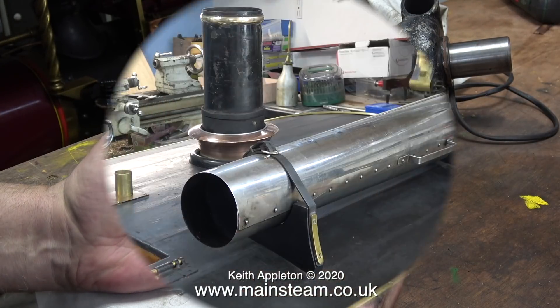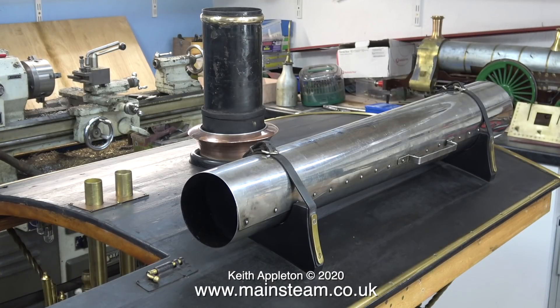I need to make a blower for the traction engine. The traction engine actually raises steam without one, particularly if I use the very long extension chimney, but it's still very smelly and very smoky. The shorter extension chimney is for when you drive the traction engine — it makes it so the steam and smoke goes over your head when you're driving it, because it's difficult enough to see where you're going in the first place.